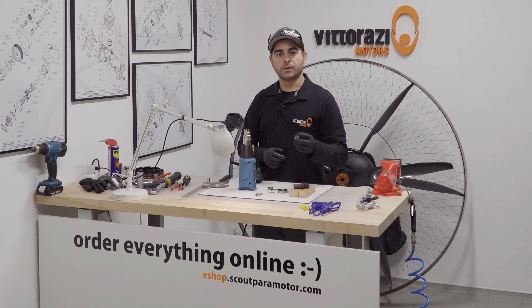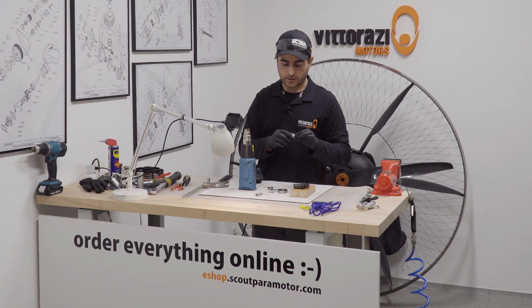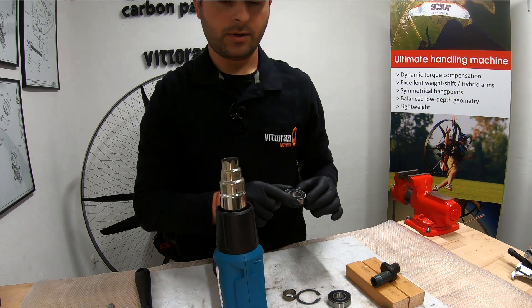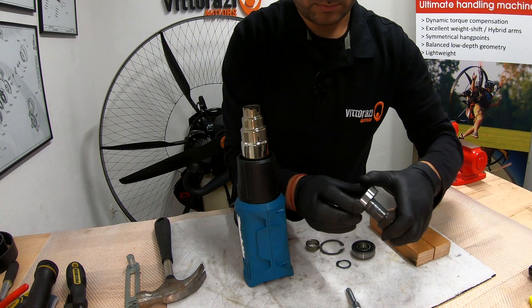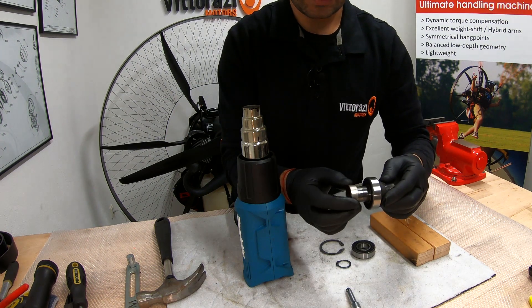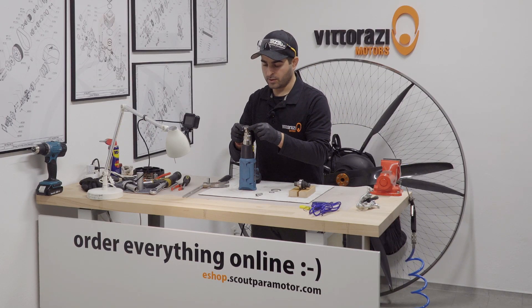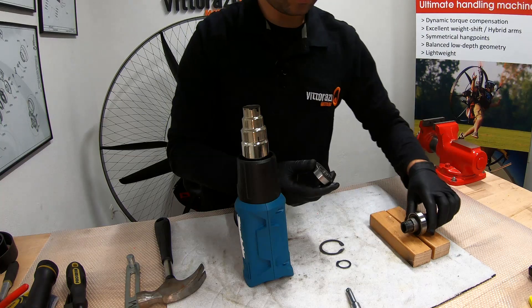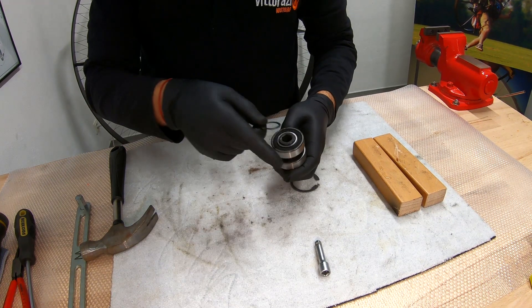We will do 4 sessions of 4 seconds on the gun, 2 seconds out. After completing the heat cycles, the bearings just slide right in. Now install back the C-clip — please be sure that it snaps in after installing the C-clip that retains the bearings in place.